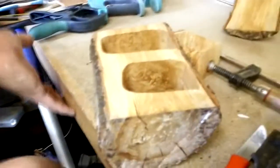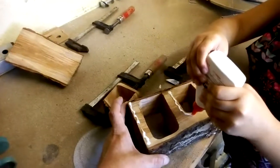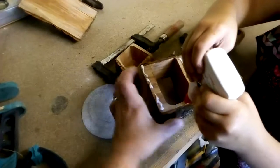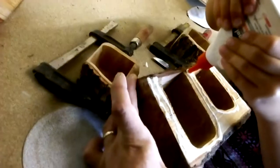So now you glue the top here, glue around here, and then clamp the back onto it. Here you can put a little extra glue — put some here — around the drawers are really important. Around the drawers and around the edges. Put some here, but not too much.